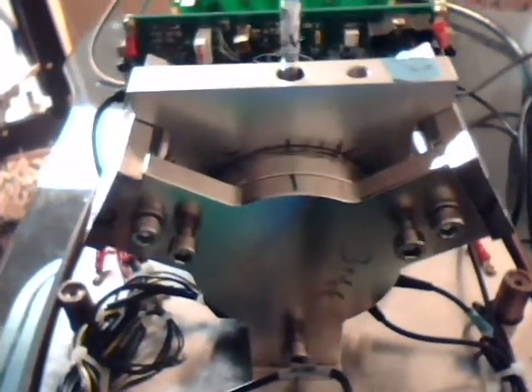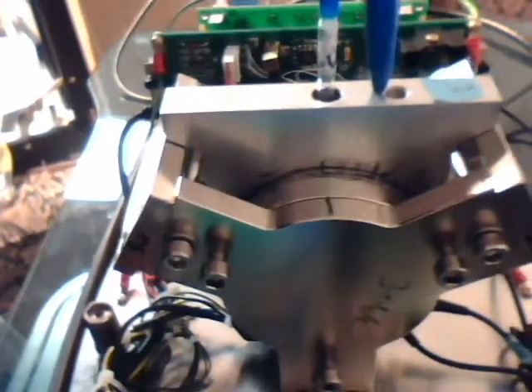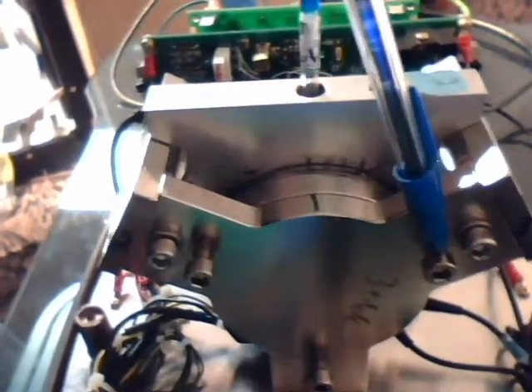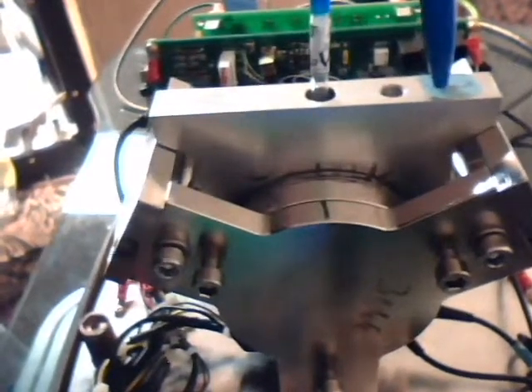This is a picture of the acorn area yoke with the cassette assembly installed. I'm viewing it from the front, closest to the blue LED. You'll see that there are three screws located on the inside circle of this yoke, which are used to hold the cassette in place.